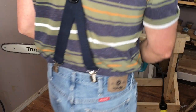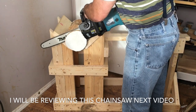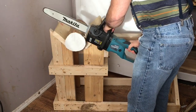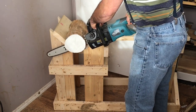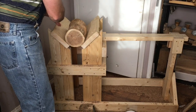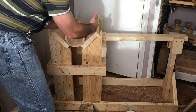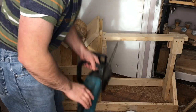These are just basic examples — you can put it in the V section there and trim the ends. On really big logs you can take and cut flat on each side so that you can mount it on the lathe easier. Then you can mill your two bowl blanks and then a center strip down the center that'll include the pith. Then you can either flip that slab sideways or put it there and mill those little quarter sections out of that slab. We'll see how nice and stable this remains.